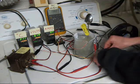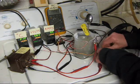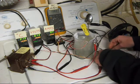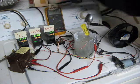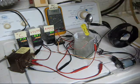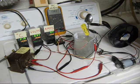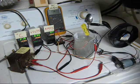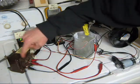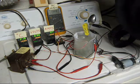Okay, so let me wrap this a little bit more securely. Yeah, there we go. Sorry. Okay. So that's just this running. It's drawing 400 milliamps, and it's pulling the supply down, rectified output down to about 6 1/3 volts. It's drawing 1.3 amp now, 1.38 amp now, from the outside secondary of this, disregarding any current flowing through the center tap, and there is some, just not capturing it right now.